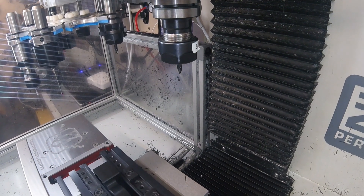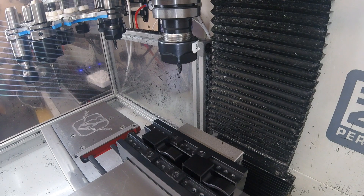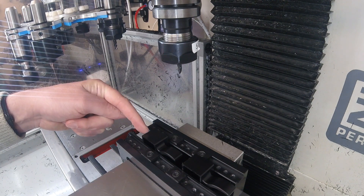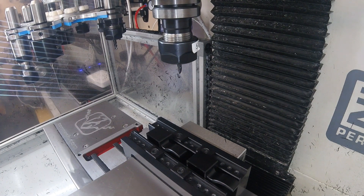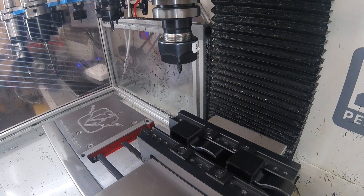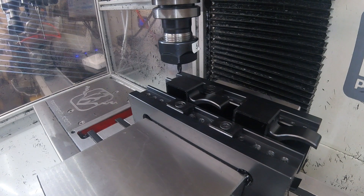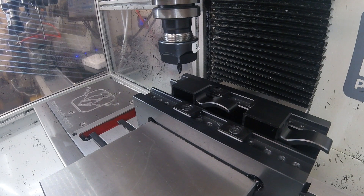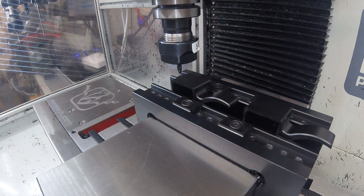You can just about see if I jog this into a more reasonable position — you should be able to see the two of them sitting there now. The CAM's all done in Fusion 360, and the work offset origin is supposed to be in the middle of that edge there, and that edge there. Slightly unusual place to put it, but not an issue if you're doing the probing automatically, so really all I have to do is jog the thing more or less into position — really doing nothing more than just eyeballing it. That's not too bad a position for X and Y, and that's within a millimeter or so for the vertical axis, so I'll set my origin just there.